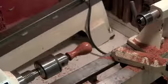Digging through my turning stock I found another blank, cut it to 13 and a half inches, cut quarter-inch-long tenons, and got a good fit. The silver lining: this piece may be the curliest maple I've ever seen — tight tiger maple on all four sides. I'll take the saw apart, refit the whole thing, tension it up, make sure everything looks good, and then resume shaping the side pieces.